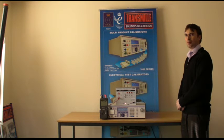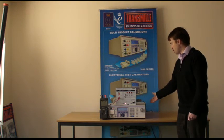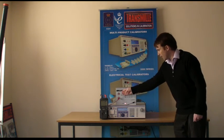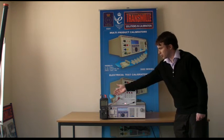The breakdown test voltage measurement timer function can be used with the breakdown test adapter. The adapter is connected via an interface lead to the rear of the meter. The voltage signal is then connected via the 12kV or 3kV connections and the ground connection across to the voltage source.